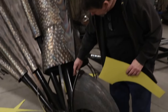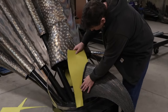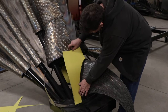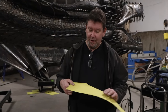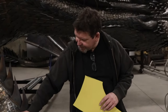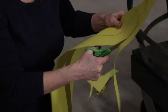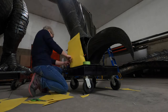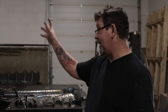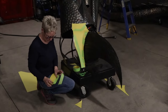We're building the cuticle - this is going to be where the skin ties into the claw. I had Michelle make some templates for me and these are going to go on here. After these templates are fitted, we'll transfer them to steel, then cut the steel, heat it up and give it the coloring of the dragon, and take it over to the power hammer and do all the hammer texturing to make the finish blend right in and around the claw. It's a bit of a long process making sure everything fits - especially since this is kind of in your face when you're walking up to the sculpture. The claws and wings are one of the first things that draws your eyes, so we want it to blend in and look nice.